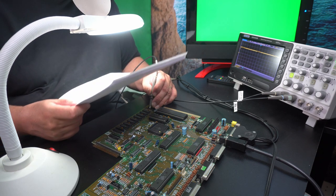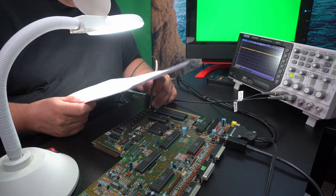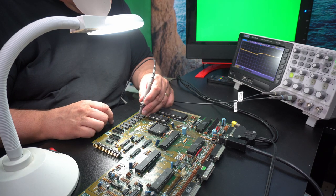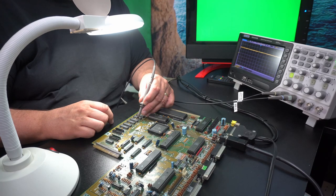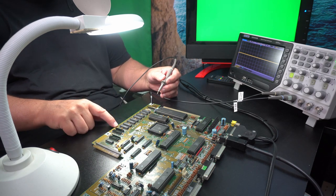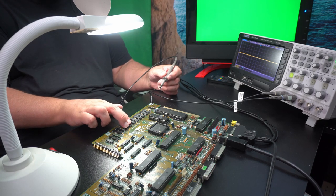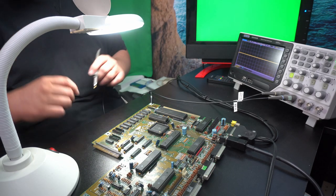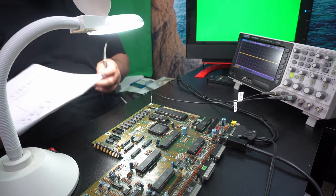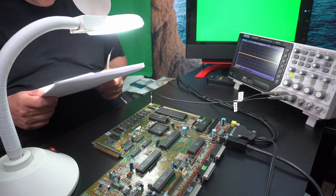Let's take another chip, because this could be higher up on the address range. So let's take the same 3 on that one. Let's see. Yeah, there it is. So this is the high end of the memory, probably, and this is the low end of the memory. That's why it's not happening. So I should probably have taken these two chips, because these are two separate memory banks. Okay. Ah, wait. Yes, exactly. Then we've checked address, row select, column select, write enable.